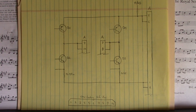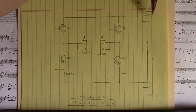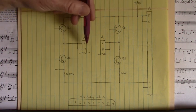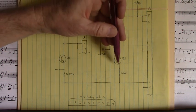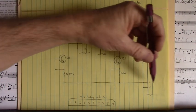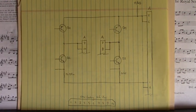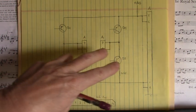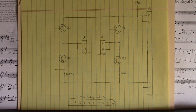If we wanted to move in the opposite direction, we would turn Q4 and Q2 off, and we would pulse width modulate Q1 and Q3. And so now current flows from the 24 volt DC power supply through Q1, through the motor in this direction. Notice it's current flow in the opposite direction, through Q3, back to bus ground. So we either go in this manner or this manner. That's how direction is determined, by which two transistors are turned on and turned off.